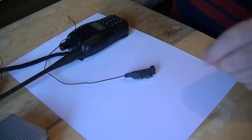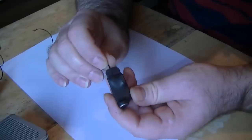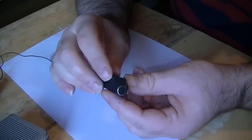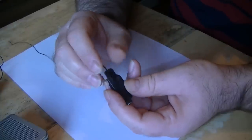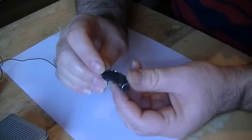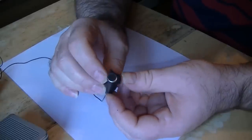In this video, what I want to show you how to build is a transmitter like this. Now, this might look similar to the transmitters I normally build, but this is a UHF transmitter. It transmits on about 434 megahertz. It's a PLL transmitter, so it's phase locked loop. So holding this transmitter or putting it on your body anywhere, or lifting it up, touching the antenna or the battery, you will not move the frequency, it's rock solid.